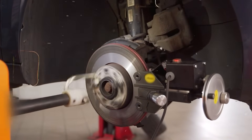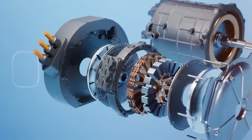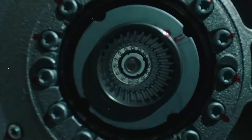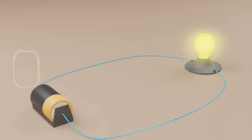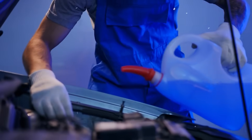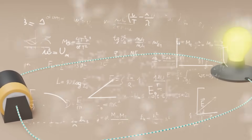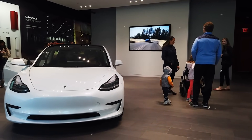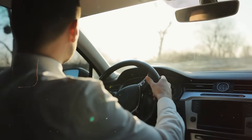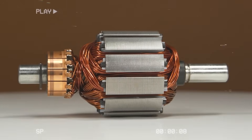The clever part is that the winding now does double duty. It transfers torque reaction out of the active part of the machine and into the housing, helping to stabilize the stator. And because the bars are thick and continuous, they also act as a heat highway — heat generated in the copper flows along the bars into the end shields and housing, where coolant can remove it. One design choice solves the structural problem and the cooling problem at the same time. Deep Drive also argues that these bar windings are well suited to automated high-volume manufacturing, making the topology buildable at scale.